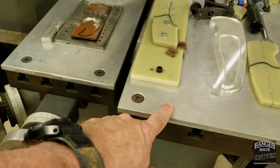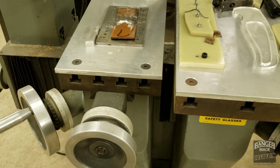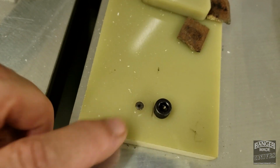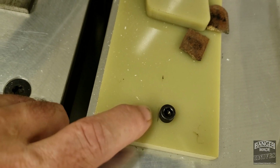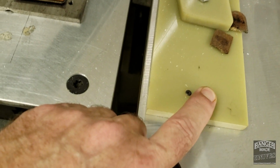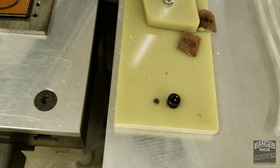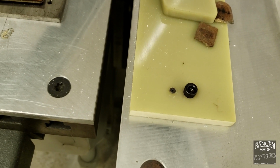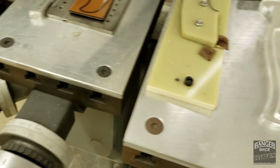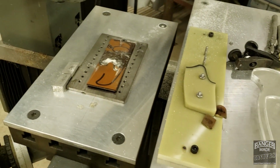I made these sub plates, and both of these aluminum sub plates are done with MIC 6 aluminum tooling plate. Everything on the sub plates is held down using basically a dowel pin system. So there are threaded hardened steel inserts in the sub plate, and then these dowel pins register in hardened sockets inside the fixture plate. That gives me some repeatability, allows me to take stuff off, put it back on, and it's just going to register in the same place.